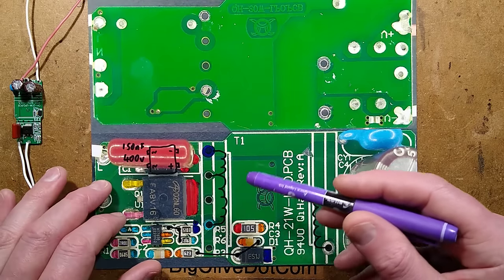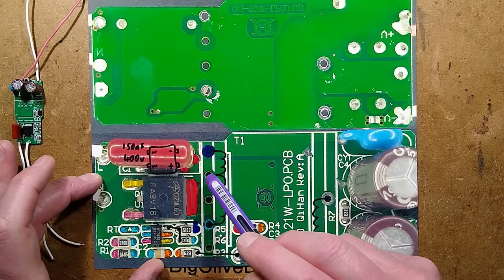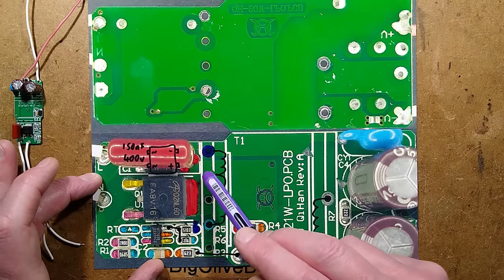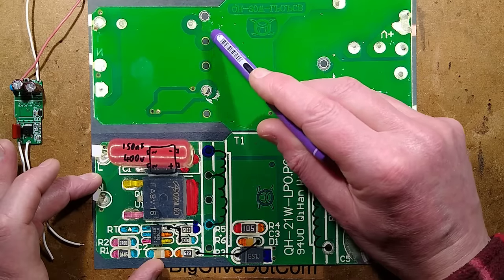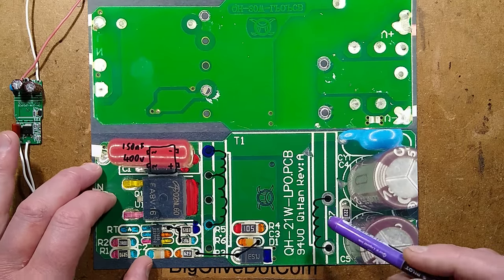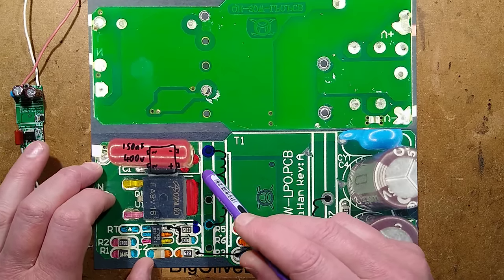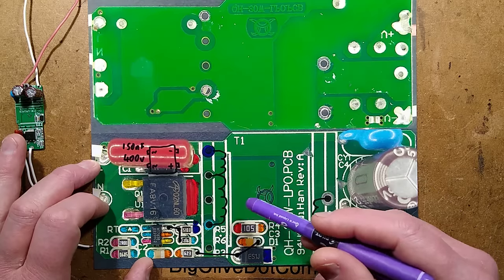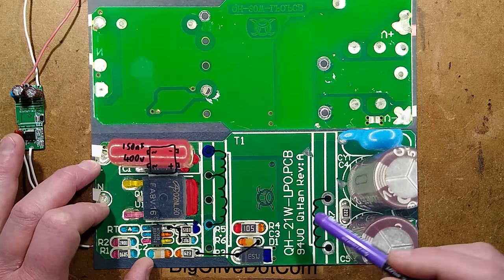It may be a universal transformer, but that tap — although it's not soldered — goes through the circuit board and is effectively connected to negative, and it's very close to this positive ground plane. Instead of having a nice wide island around it, they've got virtually nothing. That is an issue: if there are humidity problems, it could result in tracking. Particularly on a 277 volt supply, the voltage could approach the best part of 400 volts.